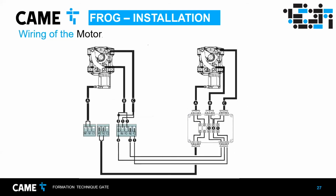In this kind of motor operator, it has basically 5 cables. Two are M and N. Remember that, you can take note of that. That's for the actual DC motor, M and N. And one of the tests we do is put a battery between 12 and 24 volts. You can put a battery there and the motor should move. And you can reverse the polarity, and it moves in the other direction. That's one test we do all the time. So remember, M and N is the actual motor.